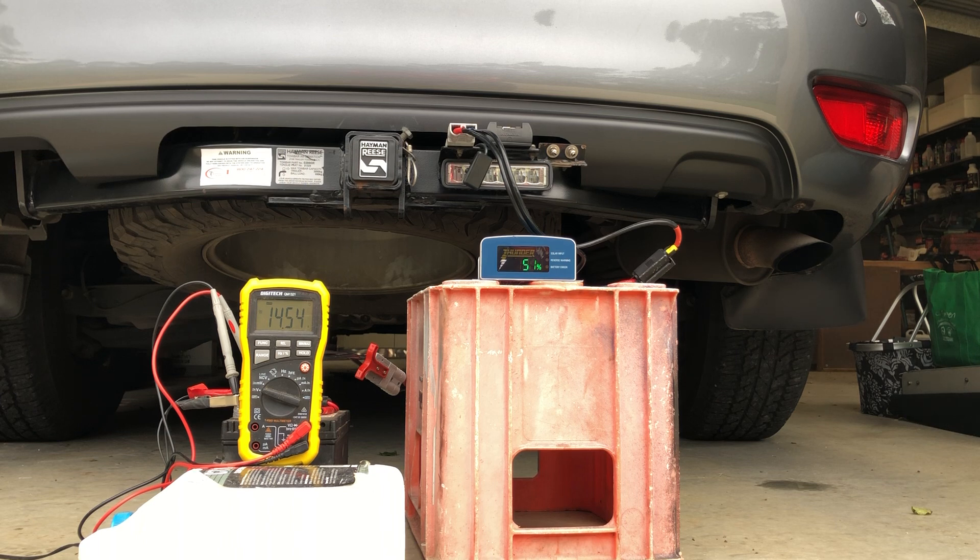Just keep an eye on those voltages on the voltmeter there, because when solar is going in it's actually shooting up to 15.6 volts. I do not use that for solar under any circumstances, because if you've got a fridge or some other sensitive circuitry it could blow it up. It's now saying it's reaching 84-85% in its charging cycle and still pumping in 14.56 volts.